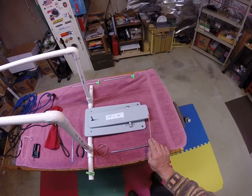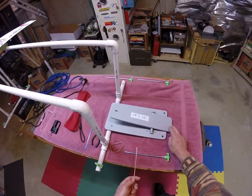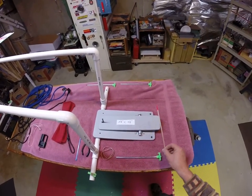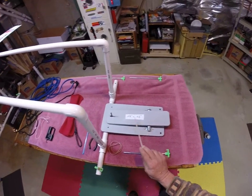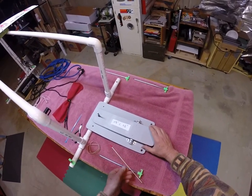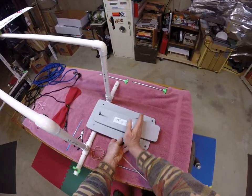The distance from here to here is about one-third of the total length of the pedal, so the pedal will naturally want to fall down. That's important so the pedal will not want to go off like a hair trigger. At about one-third of the total distance of 13 and three-quarter inches, I have it both screwed and glued — I'm an old woodworker, so I use a lot of woodworker's glue. Make sure this is perpendicular to the pedal.